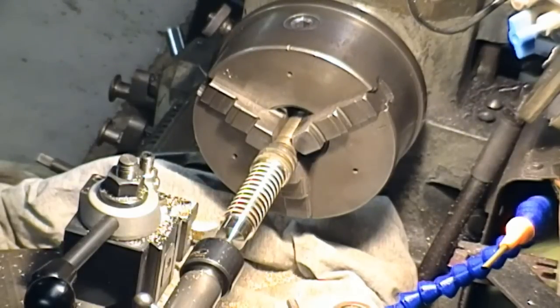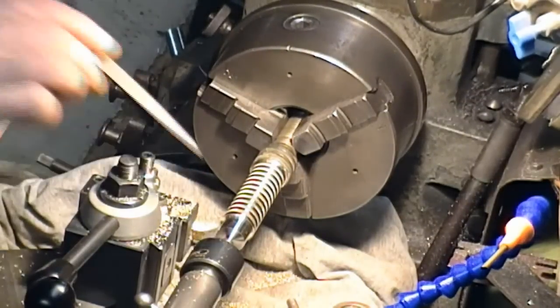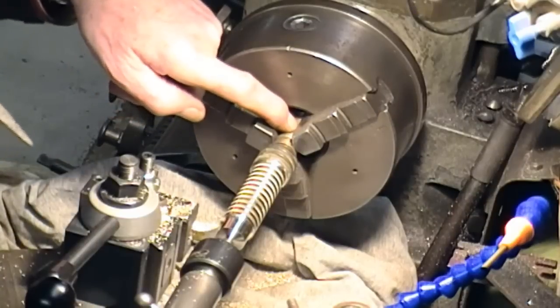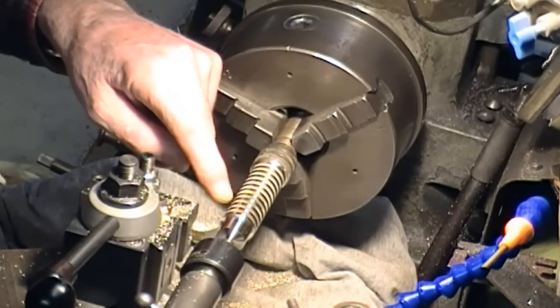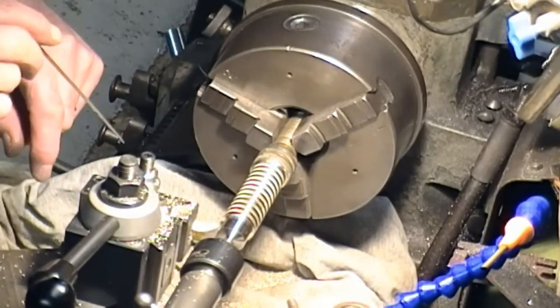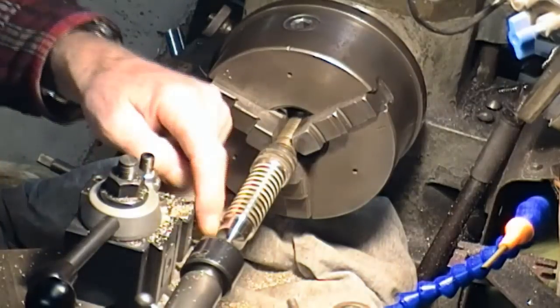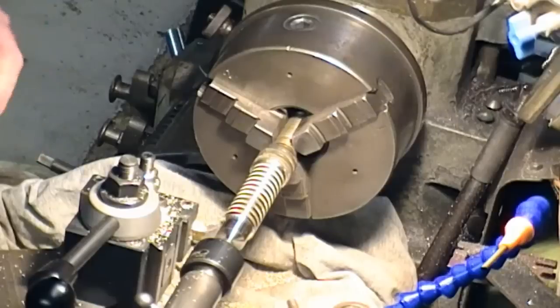I've already taken a light cut and I'm going to go a bit further. I put a center in here by the way - this was very difficult to get to run remotely true, it's not perfect on this reduced diameter, but I put the center in as a temporary measure and I'll machine off the end later. Some people may remember that I save my brass shavings - keep all the chips, they go in a jar, and for a large brazing job they can be quite useful. I don't like wasting it, so I'm taking another 15 thou off there, just a little rough because of the nature of what I'm turning off.